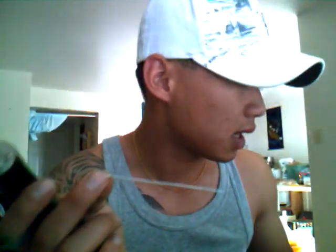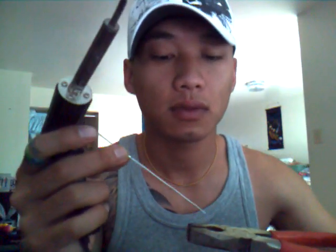Once that is done, put this somewhere steady. What I did was I held it by a plier, and leave it because it's going to stay there. Hold your solder in the other hand and start dabbing it. When the solder comes off, it's going to be round. What you need to do is make it flat — take the needle and start dabbing it and sliding it sideways so it stays flat, so it goes in the tube and doesn't get stuck. See how all this is straight and flat? There's no round part to it, no bubbling.